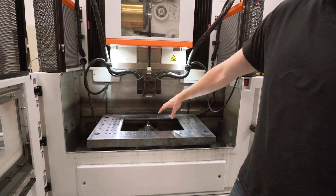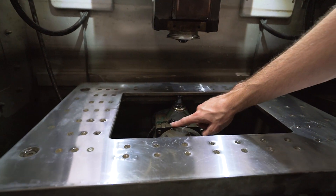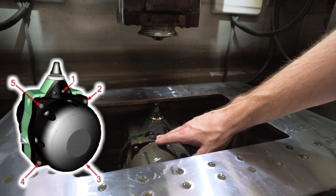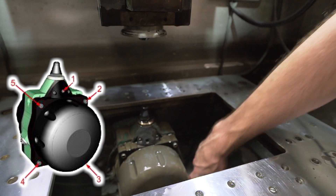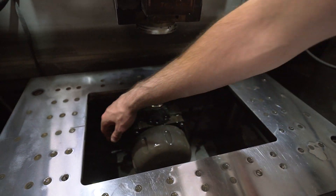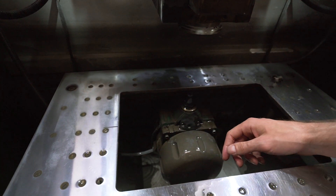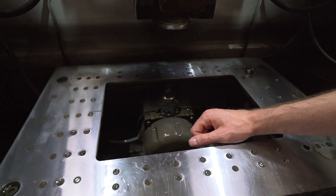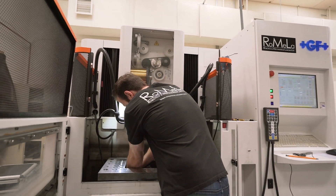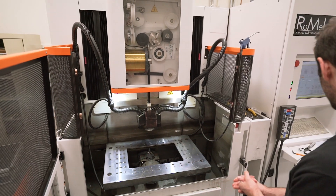To take apart the lower head there are these three bolts up here. These three bolts are what make the electrical connection. You actually only need to take out this middle bolt, which is very important, and then there are four major bolts that hold the lower head on that we need to take off, and the other thing is the ejection tube. For the ejection tube, you need to take off the clip and remove the cover — it's a push connector that you can take apart. Now I'm going to go ahead and take out the connector.